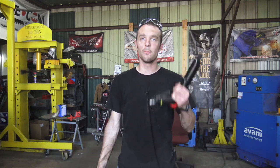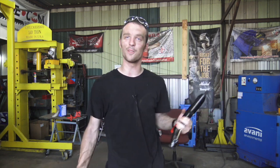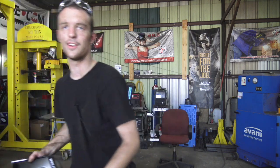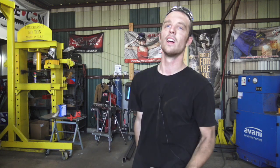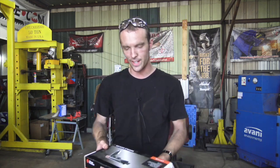So how's this for a quick review? I need to needle scale some stuff — perfect opportunity to try out this needle scaler that I bought and have been looking for a perfect opportunity to use. So let's get to it, hopefully inside of 30 seconds. First off, what does a needle scaler do? It's got all these little stabby bits out the front that go like that, and they'll pop off chunks and flakes of rust from truck frames — in this case the rim off my tractor, things along those lines.